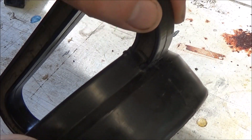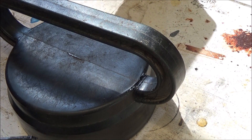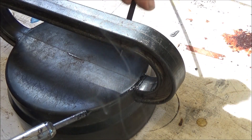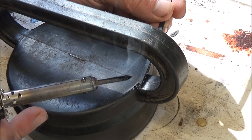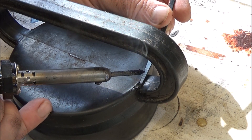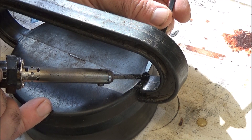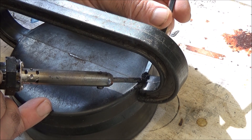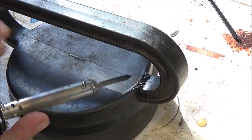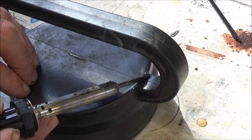We've pretty much tacked it together and it's pretty strong, but I'm going to show you how to reinforce it. One thing I found is these old plastic zip ties — they're the same material, and oftentimes they're the same color. Watch how much this fills it in. This is going to be our filler rod. Tack weld it in. You can build this up as much as you want, then pull that away and smooth it out. You've just added that thickness of the zip tie to that repair.